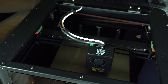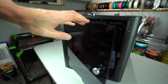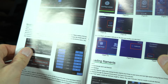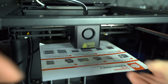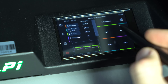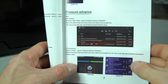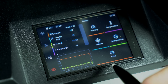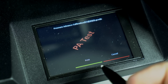Setup is straightforward — remove a few screws as indicated by the arrows, then install the acrylic panels on the sides, front, and top. The preflight commissioning process is what impressed me most about this printer. The user manual illustrates how to perform each step both on the LCD and through the web interface. It takes you step-by-step through bed leveling, setting the Z-offset, conducting input shaping for resonance compensation, loading filament, and finally performing pressure advance calibration. This is the easiest, most beginner-friendly setup process I've ever seen. It takes the complexity of Klipper and distills it down to a few easy-to-follow steps. Most other commissioning guides for Klipper-based printers stop short of pressure advance calibration, but the KLP1 includes pre-sliced G-code for this step.